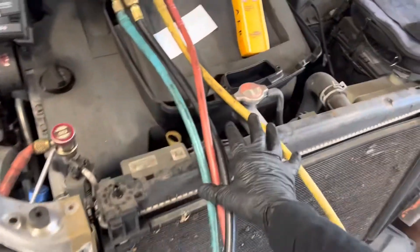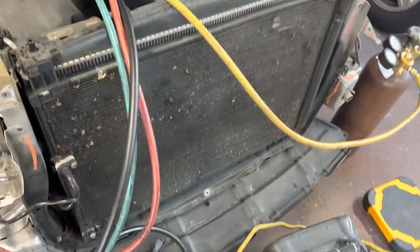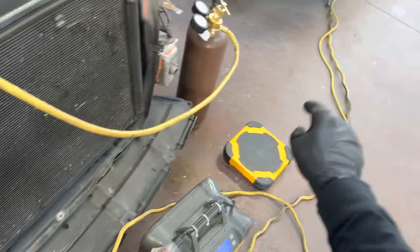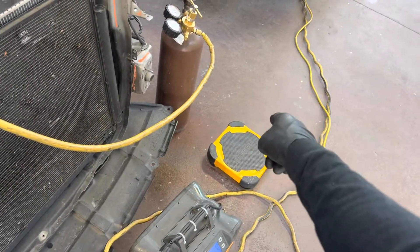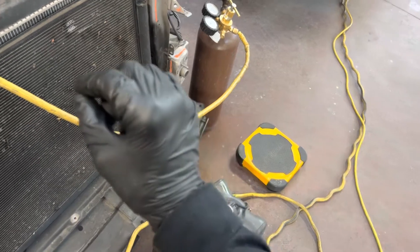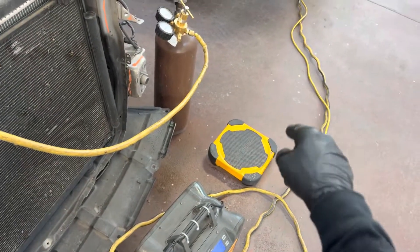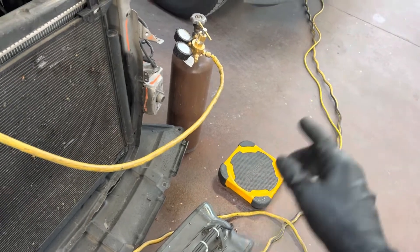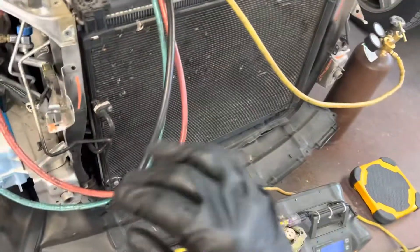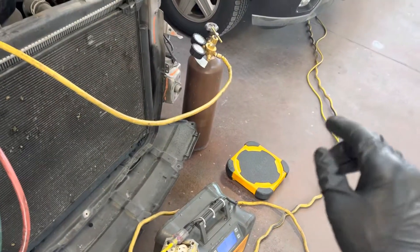I was cleaning out my gauges and making sure there was no air in my hoses prior to recovering it, so I don't get any air into my refrigerant that goes into the dirty recovered tank to get recycled later on. The less air you introduce into your refrigerant during recovery, the less work you have to do removing it. The whole idea is to keep your recovered refrigerant clean, because you don't want it excessively moisture- and air-contaminated.